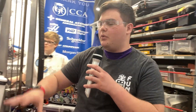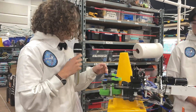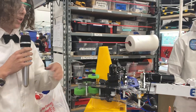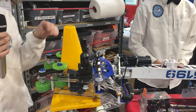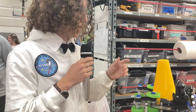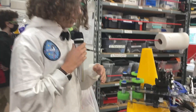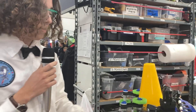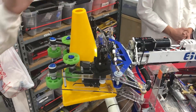This is around mark four, six, or seven of the intake. We originally started with something quite similar — it had one piston instead of two — but we were having a lot of trouble with cones: they wouldn't stay in and would be lopsided. We switched to two pistons because with one piston everything was swaying back and forth and was very inconsistent. We also tested a four-bar linkage so we could reach out without needing as much arm length. At Orange County Regional we didn't have these half wheels, so cubes would slip out; we added them along with this back plate to keep cubes held in the intake.